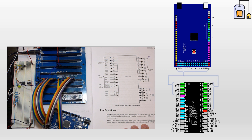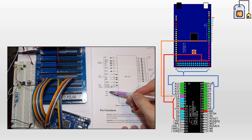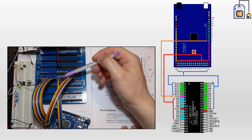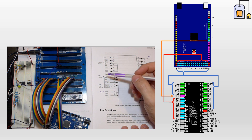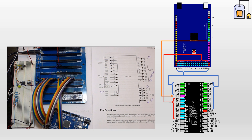The address bus connects to Arduino pins 23 down to 53 - the odd pins: 23, 25, and so on to 53. The data bus is connected to pins 22 down to 36, the even pins. Over here we've got the clock connected to the orange connector going to pin 2, with five volt and ground connected to the DC input. The Arduino is powered using the USB connector.